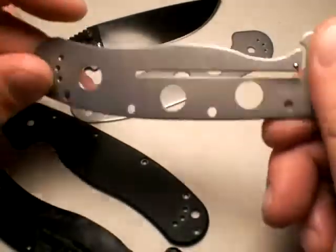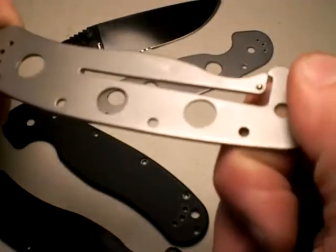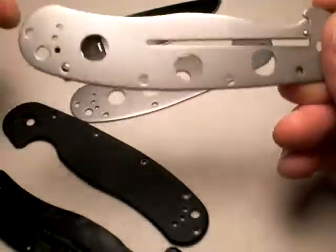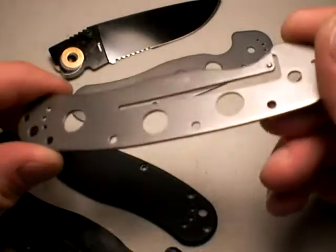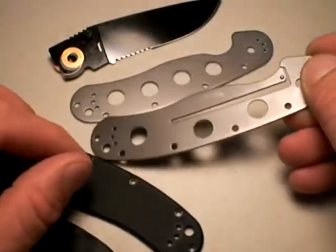This is really hard material, and I'm not sure if they made the spring portion of a different material. This one was harder to drill. I used oil — machining oil — and just took my time taking the bit through there. Don't try to hurry it; you're going to burn a bit and ruin it if you do.